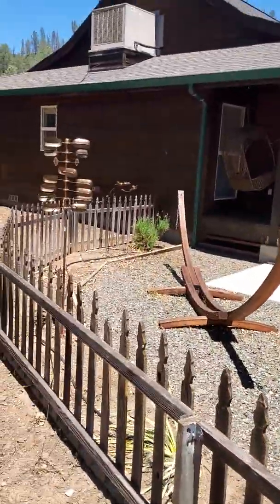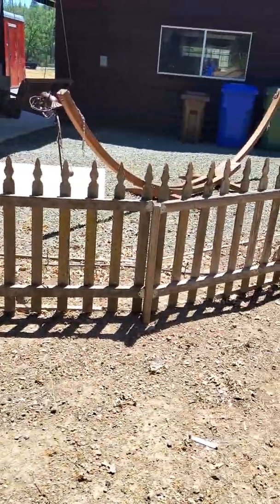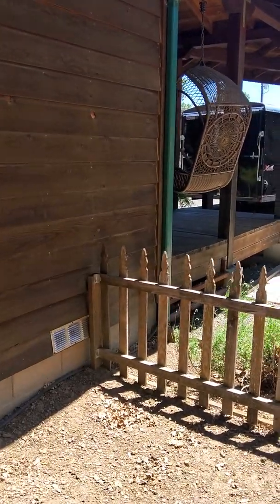So I did walk the roof, and I ran my drone up there. I'm not bringing you up on the roof because it's too hot to walk now. I just got off at the very end, and you do not want to walk a roof when it's 100 degrees outside. You'll ruin the roof. You've got about 5 years left on the roof. The valley is a California weave, which is a much better way to do your valleys. But yeah, about 5 years left, so that's something you have to save up for.